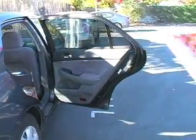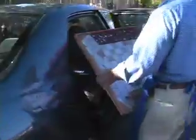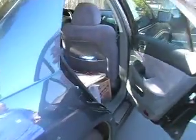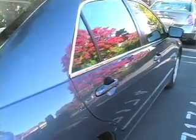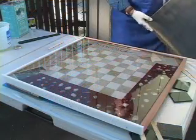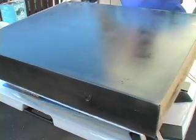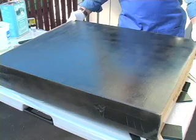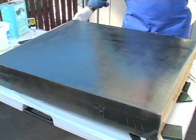Achieving a tack-free final surface can be challenging. There are 3 methods. One is to keep the piece in a very warm area. I used my car parked in the sun. However, this fills the car with polyester odor and runs the risk of getting resin on the upholstery. The black cardboard box in the sun would also work. Either way, it may take several days to achieve a fully cured surface.